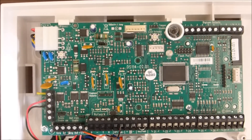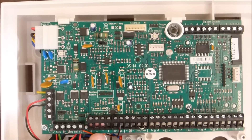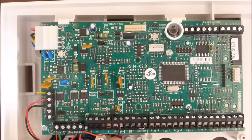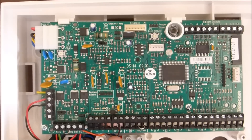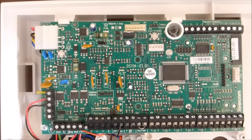Other terminals here — we have network connections. These go to the keypad, so you wire up the keypad transmit and receive and positive and negative, just so the signals from the keypad can go to the actual control panel. Opt one is quite interesting for us — that allows us to take an output from the control panel.